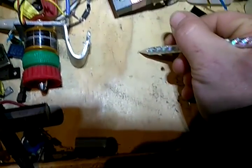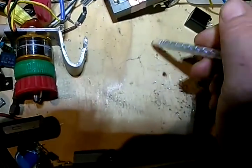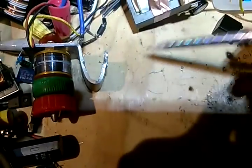On a three-phase motor you've got one end of the wire tied together. You've got three coils that come off of this motor, and those are your three inputs right here — one input, two inputs, three inputs for this motor. That's how this works. So you would feed positive, negative here, then the other wire would be nothing, then positive, negative, then nothing, then positive, negative — and it would keep going that way to make the motor turn. And that would be your electronic speed controller.